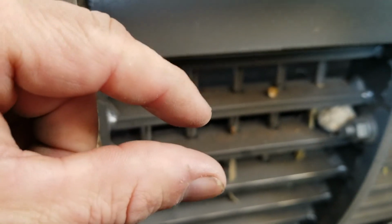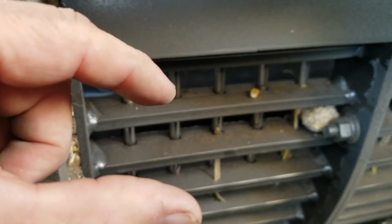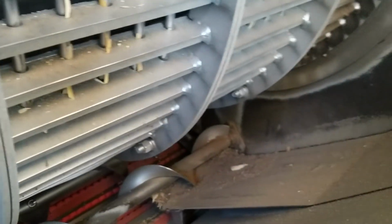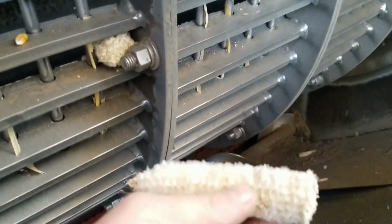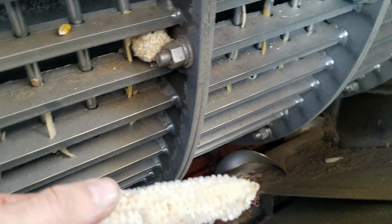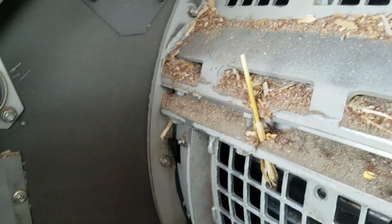With soybeans, you get it really tight because you just separate the pod. With corn, you want it wide enough to separate the kernels off of the cob, but not so far that they don't get all the kernels. This year the ears are completely varied, and it's impossible to really get it set right. But it spins, and it brings that material around, and it makes several revolutions in here. Then it comes out this side over here.